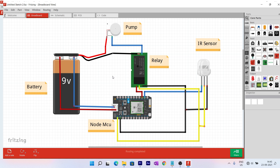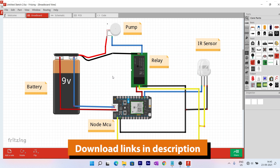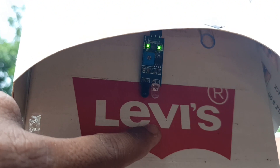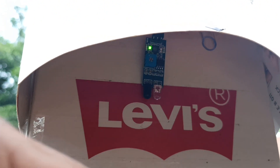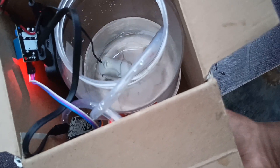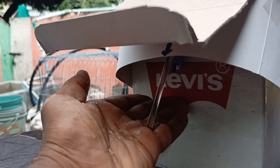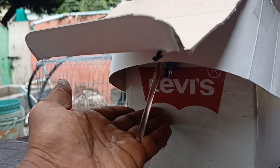So this is the circuit of the automatic water dispenser. If you have done some projects related to Arduino and NodeMCU it's a very easy concept for you. If you are completely new to this, you can learn online on YouTube — it's very simple. NodeMCU is connected to a relay and the IR sensor is also connected to the NodeMCU. Whenever you place your hand near the IR sensor, it sends signals to the NodeMCU, which triggers the relay and activates the pump. The pump is submerged in a water tank or can and it dispenses the water.